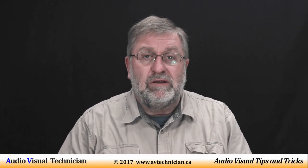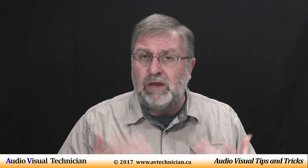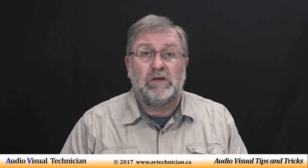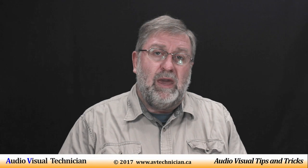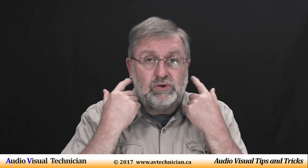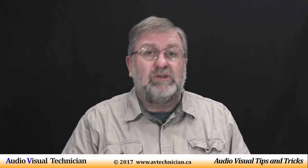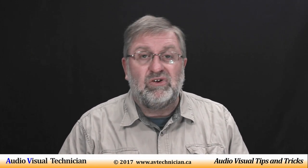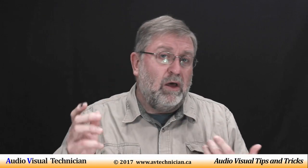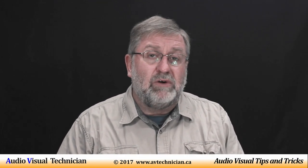A lot of people use the EQ for the wrong reasons, but unfortunately it's the only reason that really is done a lot in the AV world. When we're often having speakers speaking and wandering around with microphones, moving towards speakers a little too closely, we have to watch for feedback. We want to try to find the certain frequencies of a room that can cause trouble. Good technicians will use just their ears and dial up the lows, mids, and highs to try to clean things out. A lot of times it'll be the mids that you'll be turning down to eliminate feedback and give you enough volume, because the average user just expects that if you've got a microphone, you turn up the volume and it should just work. They don't realize that when you turn the volume up too much, you get a lot of squeal and feedback. So our job with EQing is to try to reduce that.